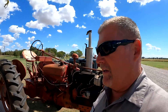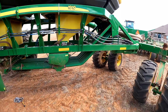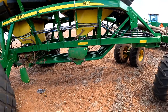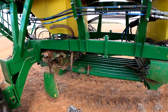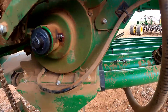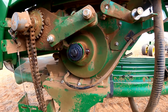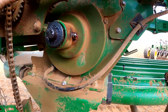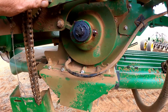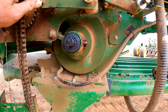We're out here at this 1910 hydraulic drive air cart with the rear tank that's not turning. Looks like the customer already pretty well figured it out — the sprocket was turning on the meter shaft, and when that sprocket walked off, it basically walked the chain off the sprocket at the same time. And it looks like it pushed the bushing out of the housing a little bit.